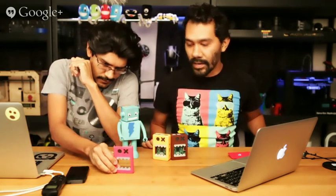It's just not going to fill it in. So increasing it that way, it'll make sure that the whole wall is actually filled in. Yeah, totally. Gaps. What layer height did you pick for that one? This is just 0.2. It's nice. A nice, not too high res, not too low res. I wanted it to be printed pretty fast, so.